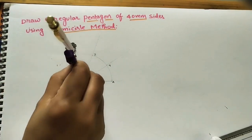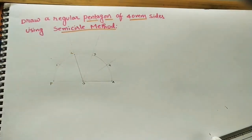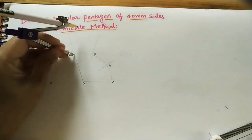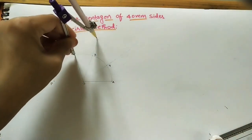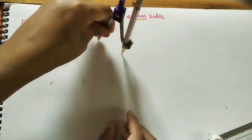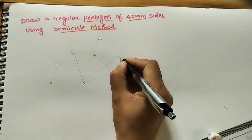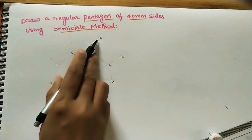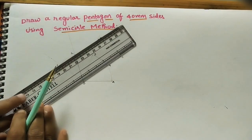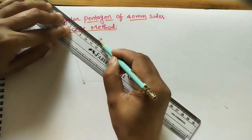O2 is the adjacent side of the polygon. In a regular polygon all sides are equal, that is 4 centimeters. From point 2, draw an arc onto the inclined line. Similarly, from the other point, mark one arc on the adjacent inclined line. Mark these intersection points — this is point B and this is point C. Then join the points to form the sides.